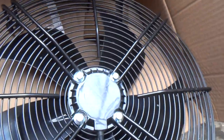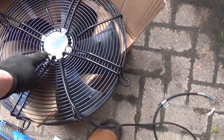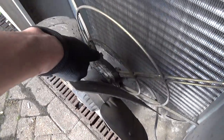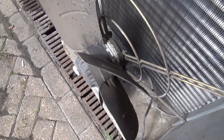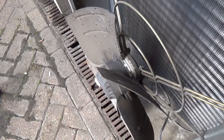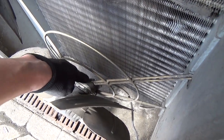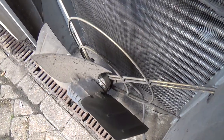You can't get the genuine Hubbard one for everything — you can get these ones from Polestar. Rather than coming with the proper spider mount frame, these come with a guard. But if you want to use the bolts, the bolt pitch and spacing is the same as on there, and you just swap that over. I'll put a bit of thread lock on them just to stop them coming undone and semi-waterproof them, because I'm not sure whether these bolt holes are open to the windings and water could get in through that gap.